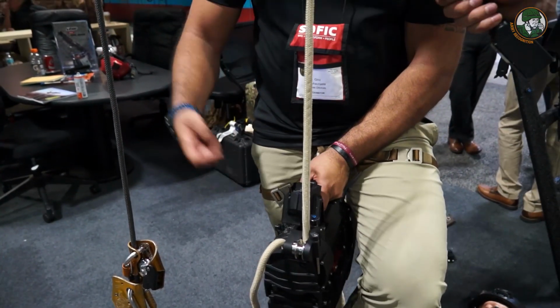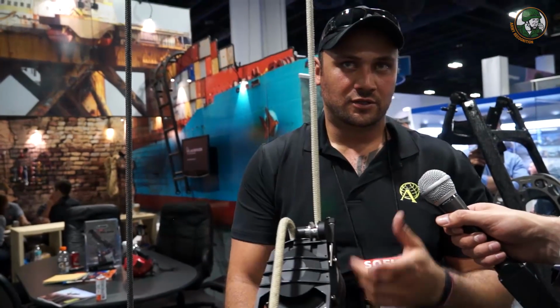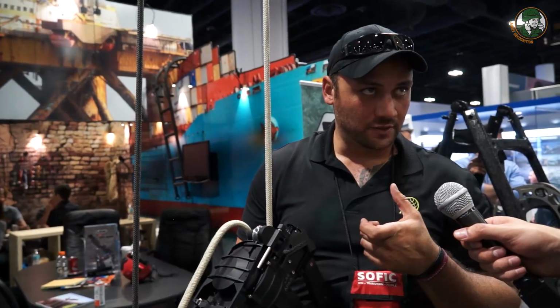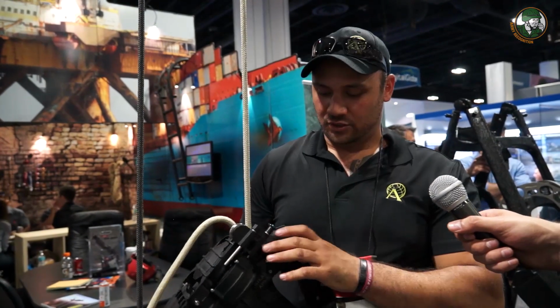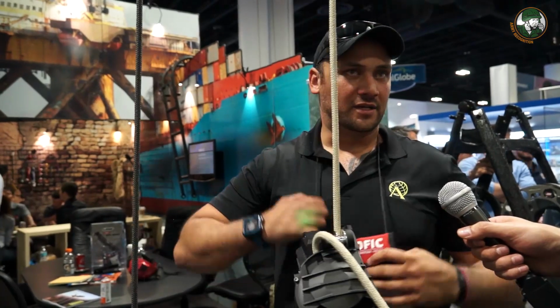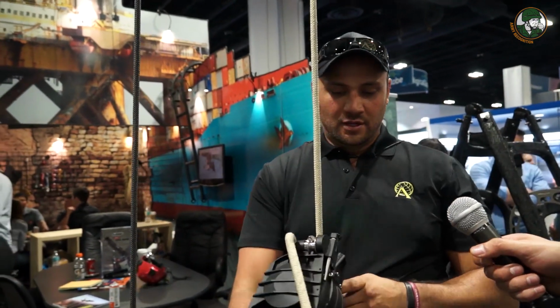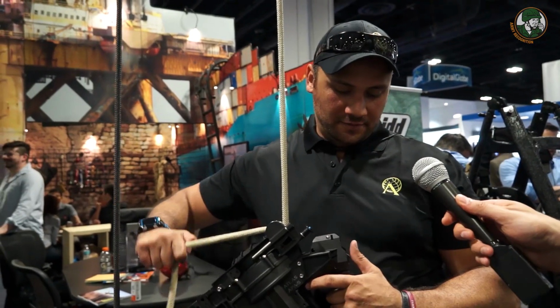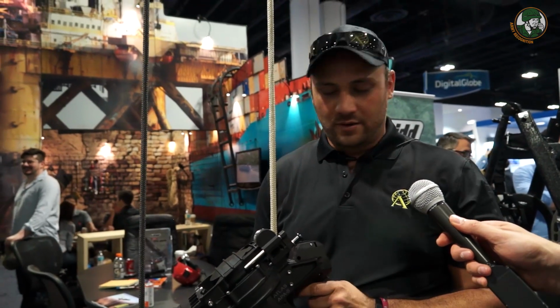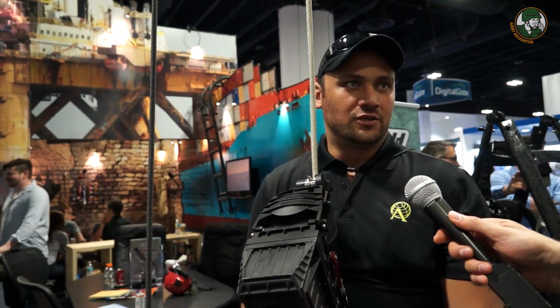After I've fired my shot up, it's a variable speed trigger. Just like a power drill, if I pull the trigger, it's going to go from 0 to 2 different mode speeds. So we have fast and slow modes. You can select it based on if there's nothing in the way or if an obstacle is in the way. You've got the up and down selectors. So if I want to go up or down under power, it's very easy to adjust. Versus with traditional rope systems, I'd have to do a lot of training and a lot of other things to make that changeover happen.